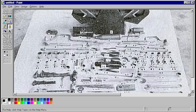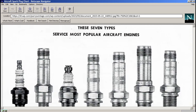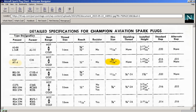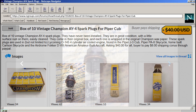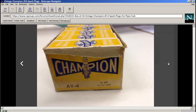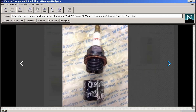I'm guessing it's one of these sockets over here. Most of the aircraft engine spark plugs I looked at were 7/8 hex, but our socket is 11/16. I did find one spark plug, the AY-4, which has an 11/16 hex. According to the sale listing I found, the AY-4 was used in Lycoming four-cylinder engines, which were hobbyist-type engines, so I doubt the Air Force was using those. But the AY-4 is listed as an alternate plug for the C-27, so maybe it was an alternate plug for some military aircraft.